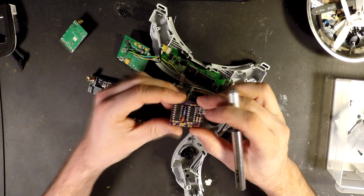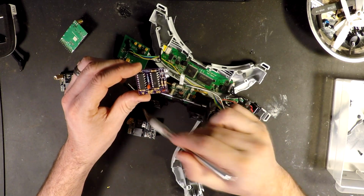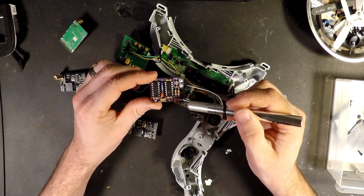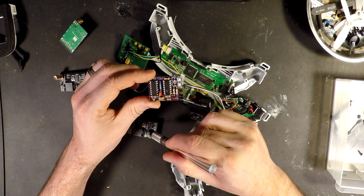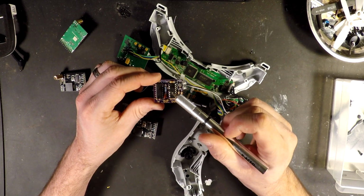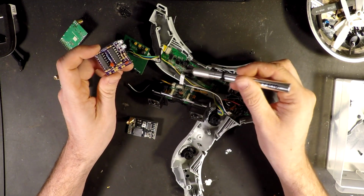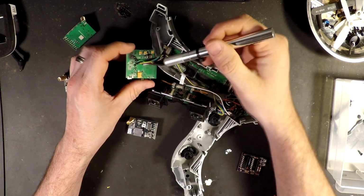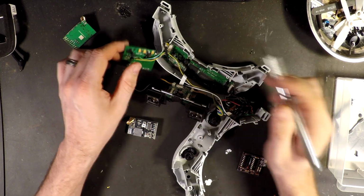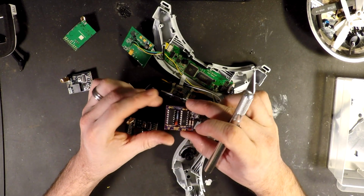So that's, you know, pretty simple. Number one, primary receiver plugged into the port. Two additional cables coming from the video and the RSSI in to video 1 and RSSI 1. The second receiver on the side, a cable from video and RSSI to RSSI 2 and video 2. So we have two inputs. And then now we have a single video out that will be going for our yellow cable that is back over here that's soldered into the primary backside of our module. So all you're doing is you got your two receivers, both into your diversity module, and one single output.